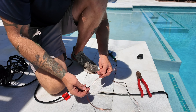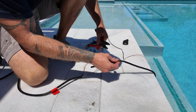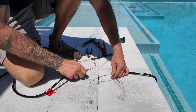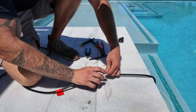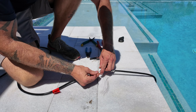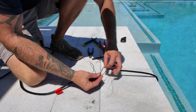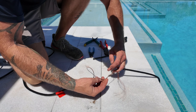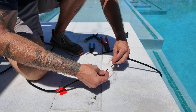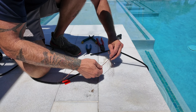Now that I've gotten the copper wire stripped, I'm going to get rid of the extra rubber on the conduit and then twist each of these wires together to give it a little bit better strength. I noticed there are only two wires here instead of three like a typical pool light — why is that? It's because everything is plastic. We don't have a metal niche and we don't have a metal junction box, so we don't need to ground any of this out. That's why in these Hydrocools you'll find only two wires instead of three — don't be surprised.